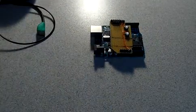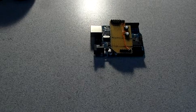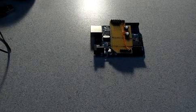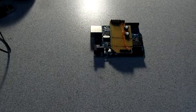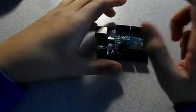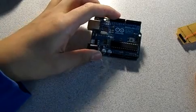The file I'm running right now is Metroid from Loud Objects' Noise Toy Library. Very cool, and I ordered a noise toy synth, but I decided I can't wait, I need the synth. So I figured out that it would work with Arduino, and I booted up the IDE and found it actually worked by compiling it. And then I hit upload, and then one by one, using two wires and an 8-ohm speaker such as this one, I connected it to ground and each pin until I got a sound. I got a sound on pins 10 and 11.